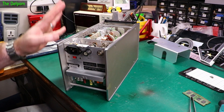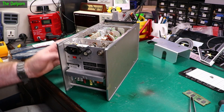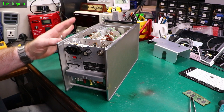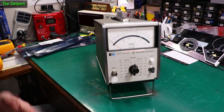I've now checked every capacitor in it and everything is measuring really well - I'm happy with all the caps. I'm not actually going to bother recapping it at all. It just looks really good inside - absolutely mint, like it's just left a factory. It's beautiful inside. I'm going to leave it alone, reinstall the covers, and then go through the calibration procedure to make sure it's calibrated properly.